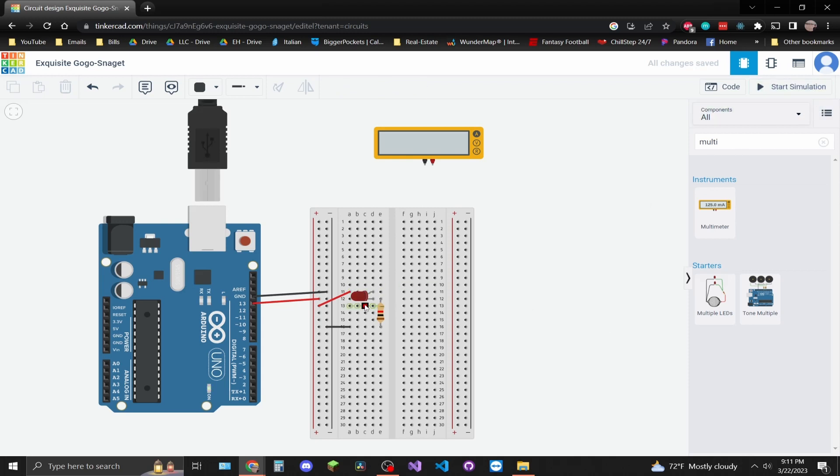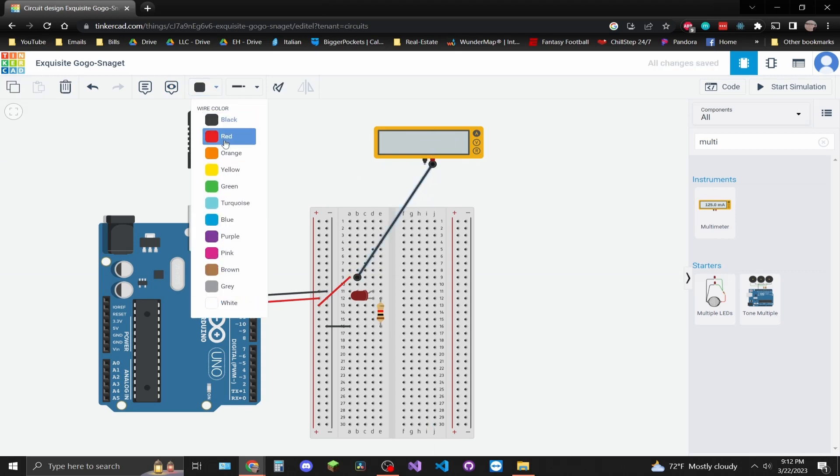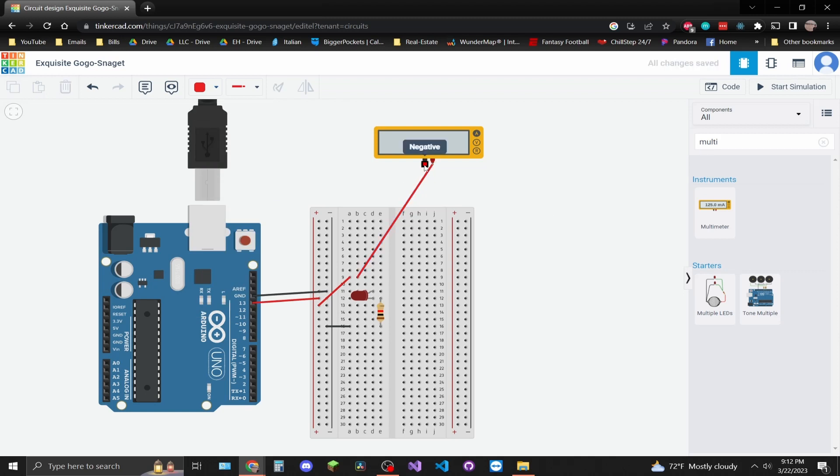I want to know how much current is flowing through this LED to make sure we won't burn it out when we build it physically. So I'm going to disconnect the circuit and bring the positive lead through the multimeter to complete the circuit. Based on our calculations it should be around five milliamps, but it's actually pulling three — because in this program it accounts for the tolerance that can change from resistor to resistor based on the quality it's built to.